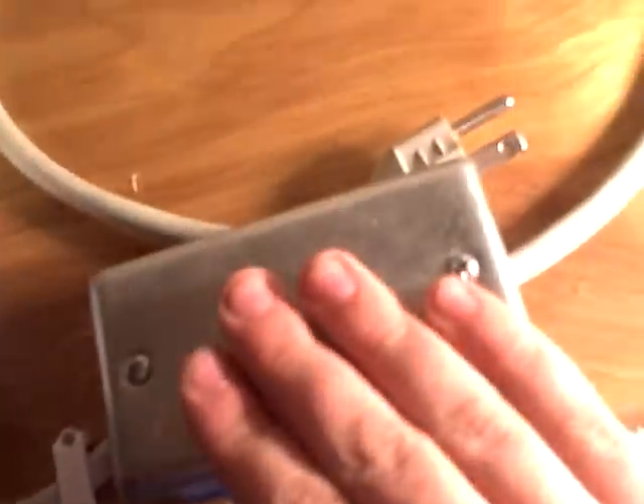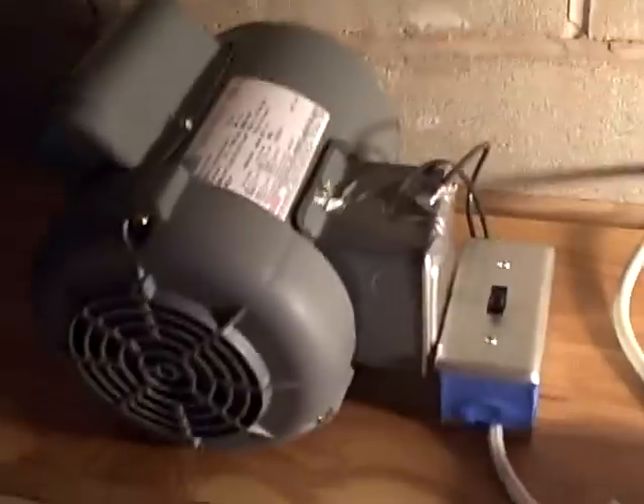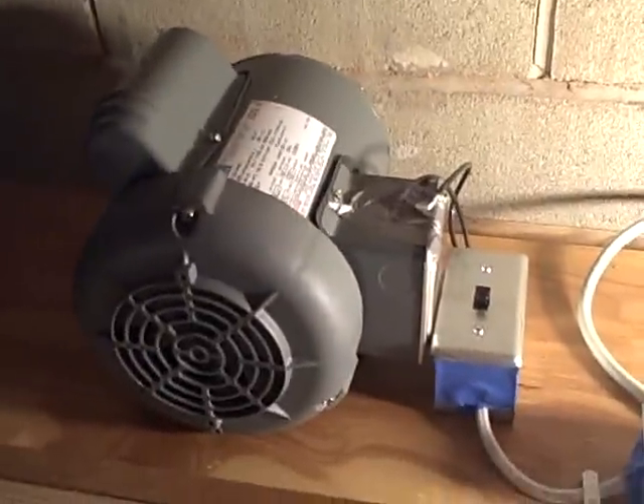Also guys, if you're wondering how my motor is doing — I wired it up professionally here. We have the 10 gauge coming in here, some 14 gauge Romex. Junction box goes to this heavy duty 10 gauge grounded cord. It draws 8.4 amps on 115 volts. If you hook it up to 240 or 230, it's 4.2 amps. So that's just an update on the motor.